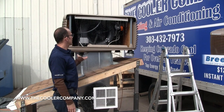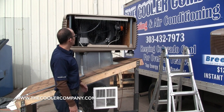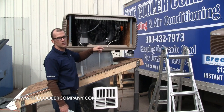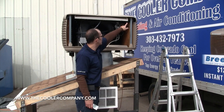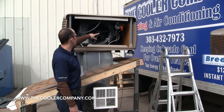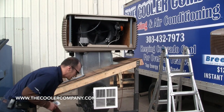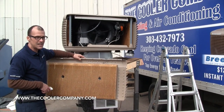Enough water filled up and the pump turned back on. Now you can really see some of the other benefits of this cooler — instead of just a couple of tubes to feed your pads, you can see the big wide distribution tray up here. It has dozens and dozens of water channels, just to ensure that the pad gets completely saturated, so you get the most cold air in your house with the least amount of water.